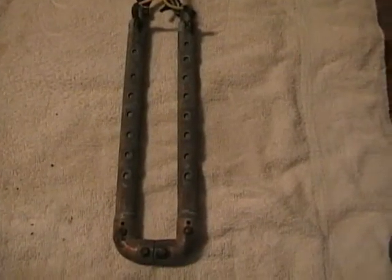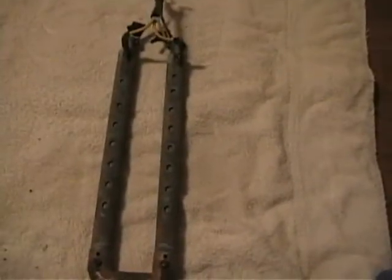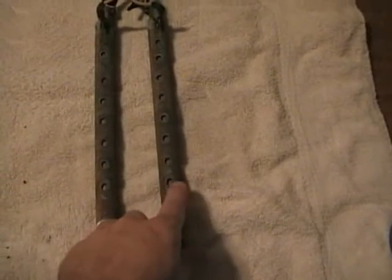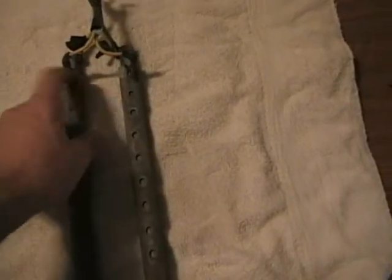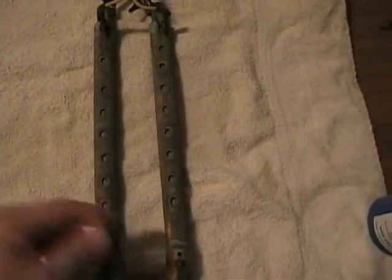This is the first one I made when I started experimenting with electrolysis. It's made up of copper pipe — two 12-inch pieces of three-quarter inch copper pipe, and running down through the inside is a half-inch copper pipe with spacers. It's drilled out so water can get in and out, and any hydrogen and oxygen bubbles that are made can also be released through there.